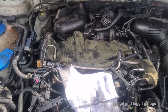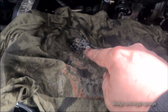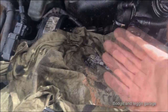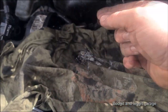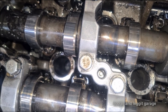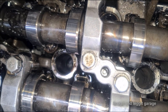At least that part's kind of handy. What I'm doing is putting some grease on the drill bit just to catch the shavings. Before it builds up too much, I keep drilling a little bit, taking all the shavings off, then put a bit more grease on. I'm cleaning it every 10–15 seconds just to keep the filings down as much as possible, because if you just let it build up, they'll go everywhere. We are about halfway down, still going nice and straight.